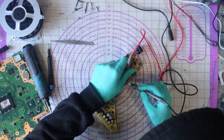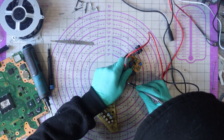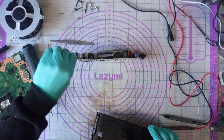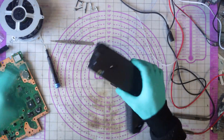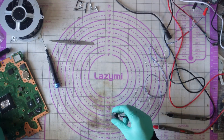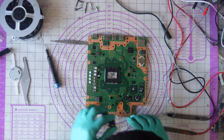Anyway, now I've got the board out, I may as well go ahead and use my bench supply to power it to test the voltage rails. 12 volts, pairing on, 4 amps of current - we have a short on the 12 volt rail. We'll get instant current draw here.